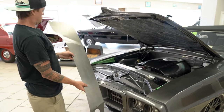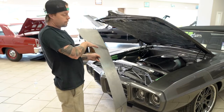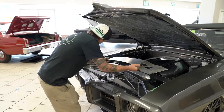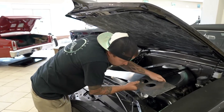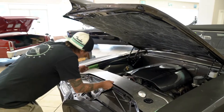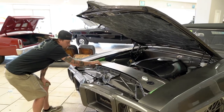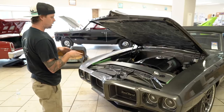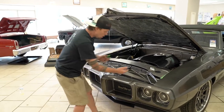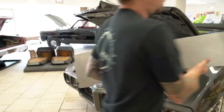What I'm doing now — we're going to have to go get a little more of — I started to roll it from here but our roller didn't really want to get in there, so I've started English wheeling it a little bit just to give it some curve, because there's a bolt I'd like to use to bolt it in right there. It's looking good, taking shape. We'll get a little more roll in it so we can use the bolt. Once it's painted and done, you won't see the battery, the radiator, or any of that stuff. Let's go to the English wheel and get a little more roll in it.